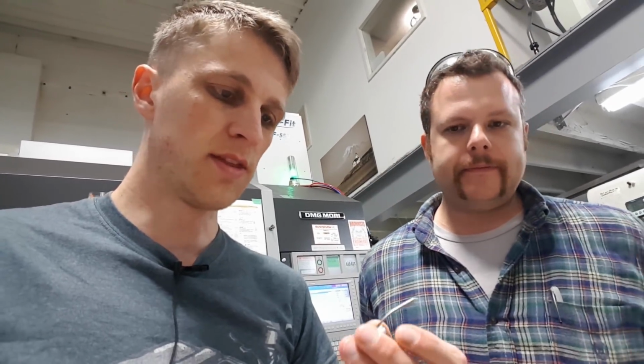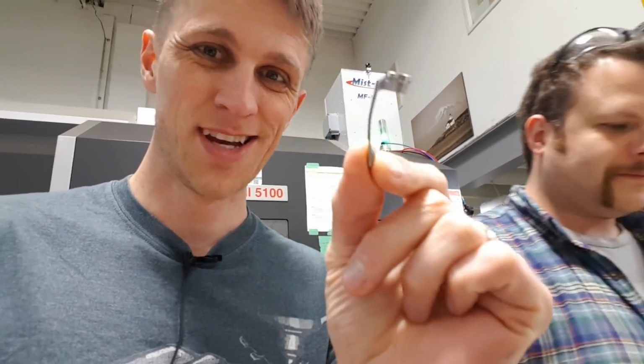There's also the modulus of elasticity. There are all the variables: adding aluminum to titanium, essentially making that alloy, creates a lot of strength behind it. Right. This one is commercially pure, and the other is an alloy with aluminum and vanadium. 6Al4V. Yeah, 6% aluminum, 4% vanadium. Let's look at the exact number. Yeah, 90% titanium. So, I mean, just don't make clips out of CP. Now we know.